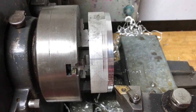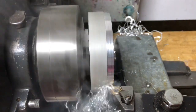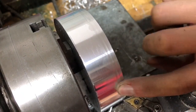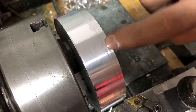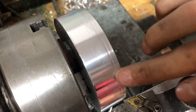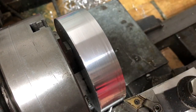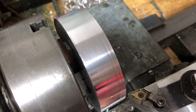I decided I'm just going to clean the OD up a little bit, just real quick. I'm getting these weird band patterns in the OD — I can see it a little bit and I can feel it too, they're like little dips. I think it has something to do with the power feed; something must be binding in the gearbox or something, slowing it down. It kind of sucks. Anyway, on to the front face — let's do this.